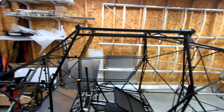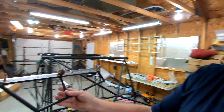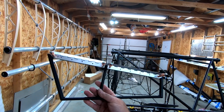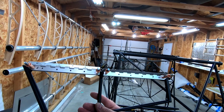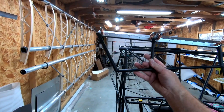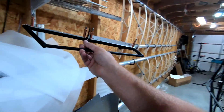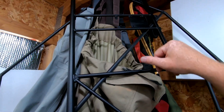Here's my plan for this week: I'm going to get my other door on. I also forgot to mention — I did work on the elevator. I put the trim plate and trim bar on, and I've got my trim tab set and ready to go. I decided not to notch out; I just did two and they're trimmed and deburred. They all fit on the elevator and are ready to go. I put my elevator on there, clamped it, and did all of that to get my trim ready. The elevator is just hanging up with weights and it's all set — drilled on the other side.